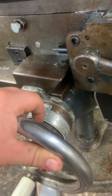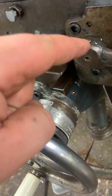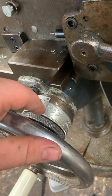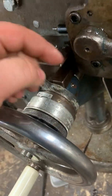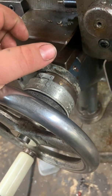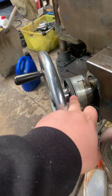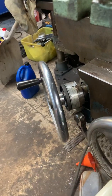There are two sort of Belleville washers — they're kind of like Belleville washers but they're like a jigsaw pattern, a square shape cut out, back to back. When I took them apart they were set up so they wouldn't be doing anything. I've tried a few different ways today, found a way that works — this now holds its zero really nicely. Again I verified it with the edge finder, pretty pleased with that. I've just got to arrange the same washers in this one, which I already stripped the other day, and then that will hold its zero as well.